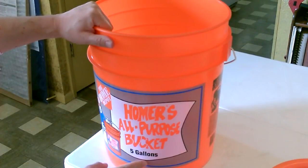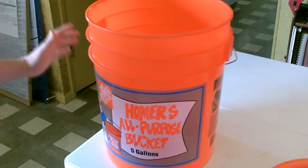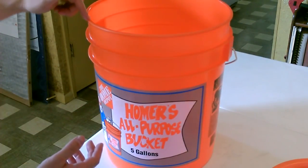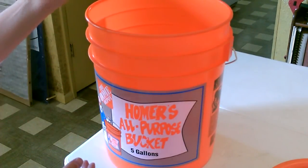The next thing I'm going to do is go ahead and drill a whole bunch of holes in the side of this, so that'll allow all the air to get pulled in through the filter material, which will be wrapped around the inside, and the fan will pull it out through the top of the lid.